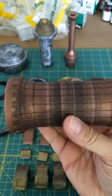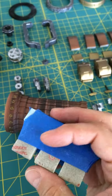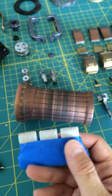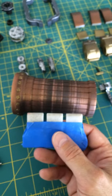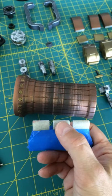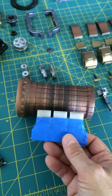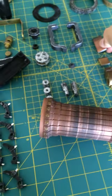I do a wash with burnt umber to give it a burnt look. Then I made a jig — 3D printed a jig. I've got two machines, both Objet, phenomenal printing. How I did this was I put sandpaper around these areas and then chucked this in my lathe. What this does is simulate the brushes that ride along here.